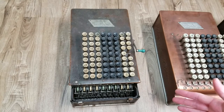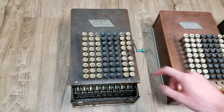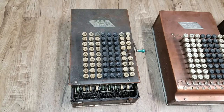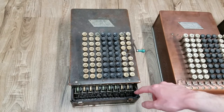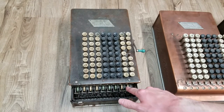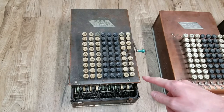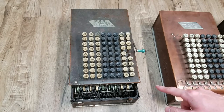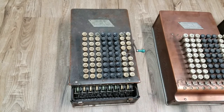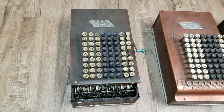As far as the history goes, the Model A was manufactured from 1904 to 1906, and it was the first of the Comptometers to feature a metal case. Before the Model A, all the Comptometers were wooden-cased. This should have a piece of frosted glass here with just little clear windows around the numbers, which is of course long broken. Another interesting feature about the Model A was it was the first model where you could push two keys at the same time. On the previous wooden box models, you could only push one key at a time in each column, otherwise you'd start to lose carries. But with this one, you can push multiple keys at a time and it still gives accurate results.